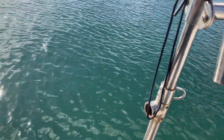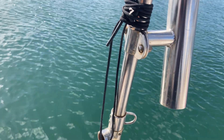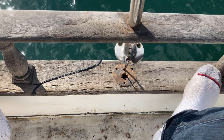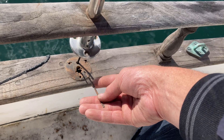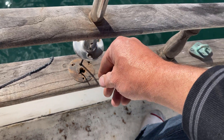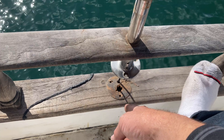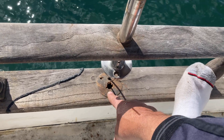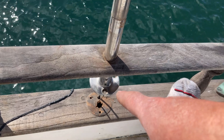There was an old GPS antenna bolted onto the side of the stanchion. I removed the stanchion and down at the base I can see where that old wire goes. Down in the boat the wire is just cut — it's not doing anything at all. From underneath there's a cabinet in the master stateroom where this hole actually comes out. So I fed through an electrician's fish tape — a metal piece that will allow me to run the solar panel wiring through the stanchion itself. When I took this stanchion off I realized these have not been re-bedded in many, many years. There's a little bit of wetness I detected underneath, so I'll re-bed this one and make sure it's nice and watertight.